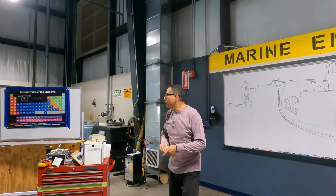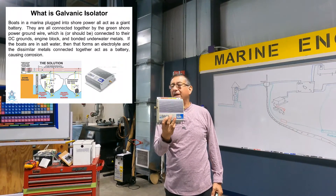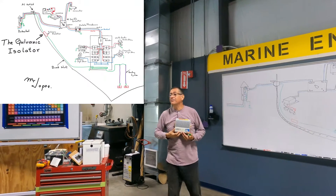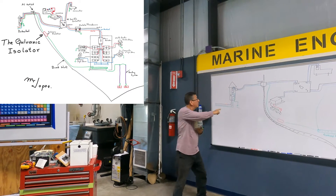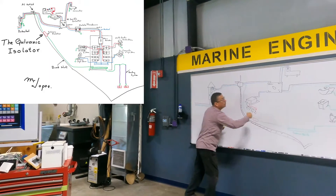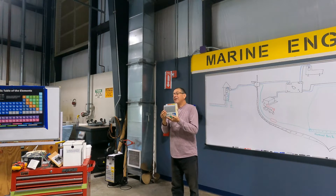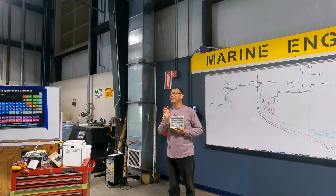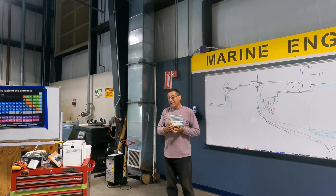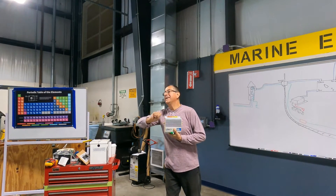That's the reason you need this magic element — the galvanic isolator. Where is it located? Look at this: the ground enters here and the ground continues here. The ground enters here and continues over there into the rest of the boat. This galvanic isolator is internally composed of a lot of diodes to block, and capacitors to store and dissipate energy. This is why they have aluminum fins — to dissipate the stored energy as heat.